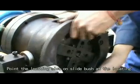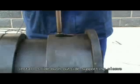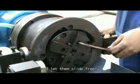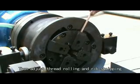Point the locating slot on the slide bush at the locating hole of the front axle cover. Install the slide bush outside the supporting sleeve, fixed by M10 screws. Loosen the screws at the cutting bodies and let them slide freely. Then adjust the thread rolling and rib stripping.